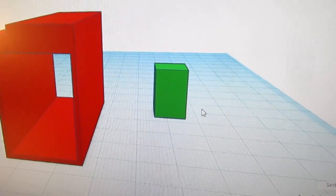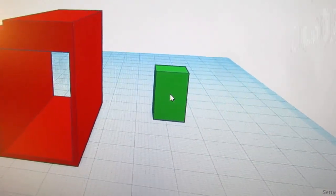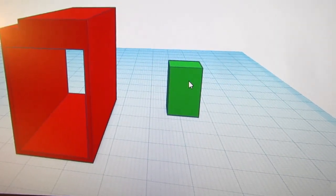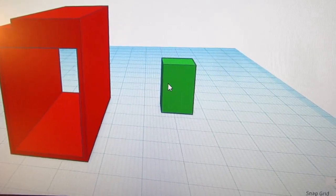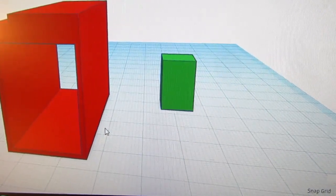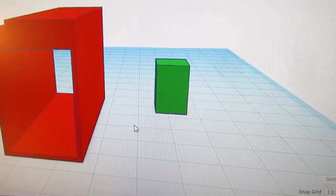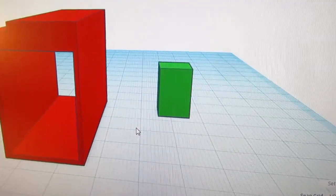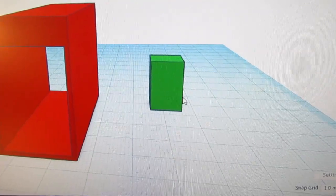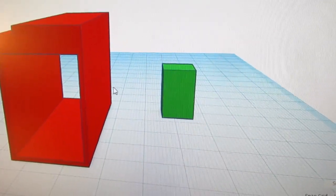Okay, I have another piece here that I'm going to try printing with it sticking out, hoping that my Prusa slicer can make a support structure for it. So I've got this in the requisite dimensions. This needs to be the shape it is because it has to be up above the bottom so it clears some components, and it can't go too far back or it'll hit the power switch, and it can't go too far forward because it'll hit the thumb screw that holds the battery compartment door closed. But it does stick out to the side enough that it rests up against the nearest XLR connector, thereby keeping this whole thing from sliding too far to the right.